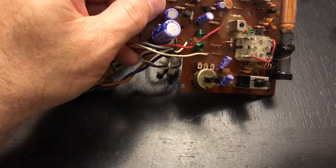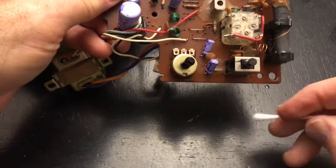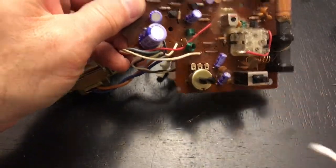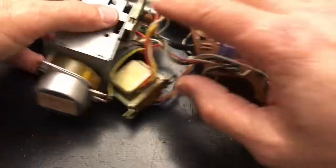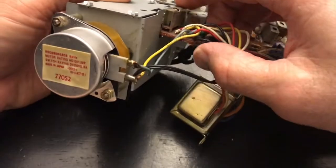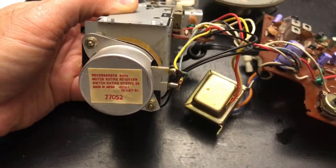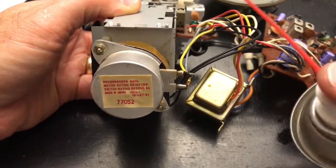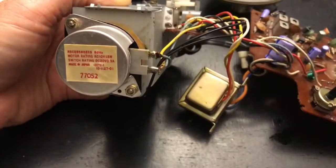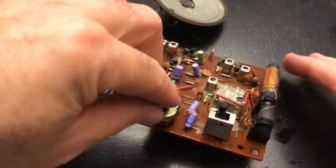I don't go through and wipe down the whole circuit board anymore - it's just not necessary. If you use alcohol it can cause some of the wax on the board to turn white, and it's just more opportunity to screw things up. That's how the radio turns on - that selector there. It's a combination switch that also controls the clock alarm. You want to just move that back and forth rapidly to get everything working again.